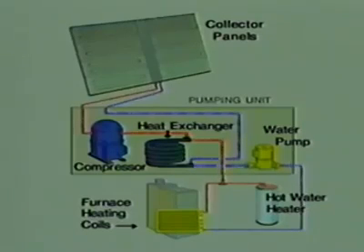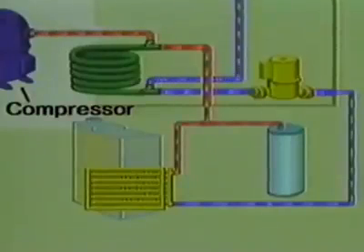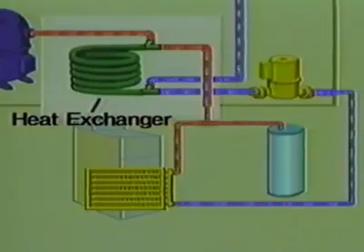Here's how it works. Because of its low boiling point — 20 below zero — the liquid freon in the collector has been turned to freon steam. There's a simple physical principle that gas under pressure becomes very hot. So our next step is to pressurize the freon in a gas pump. The pressurized gas comes out of the pump at 180 degrees, much hotter than you can stand to touch.